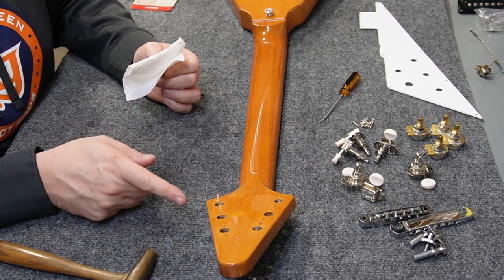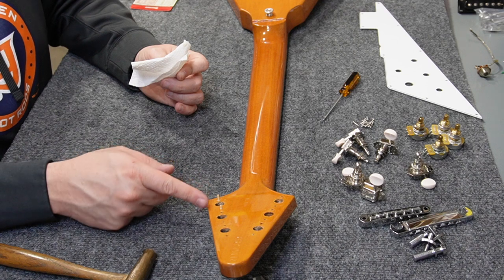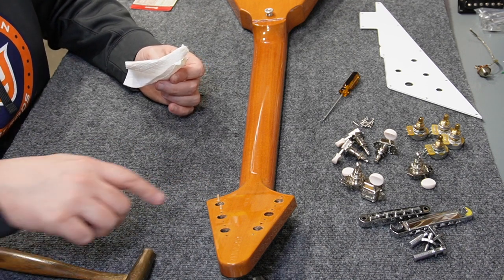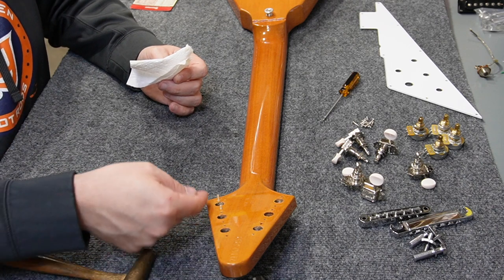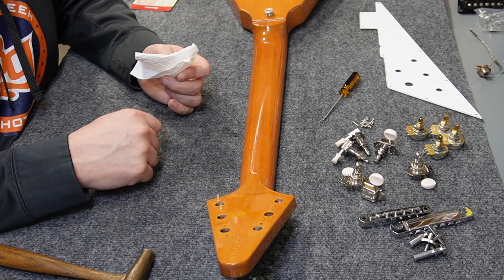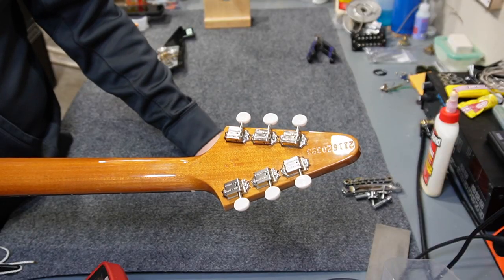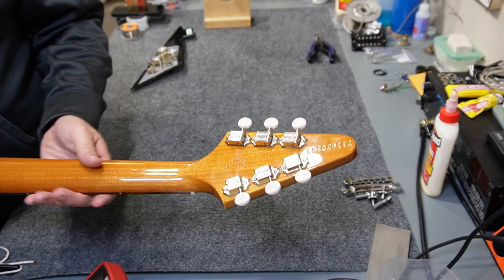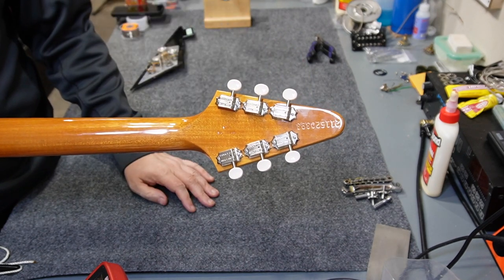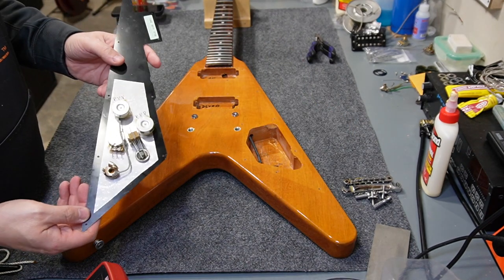Those need to dry. Once I get the other five done and they're dry, I'll cut them off flush with the razor blade — with a little bit of tape wrapped around each side just to make sure I don't scratch the finish as I cut them off. Then I'll move on to re-drilling. After the doweling, I just screwed these things on, tightened them up with the nuts on the front, and drilled the holes in the back. They fit great.